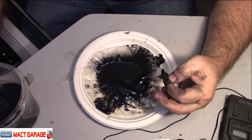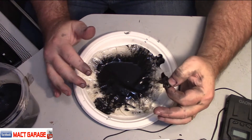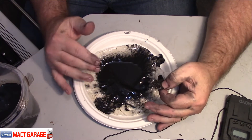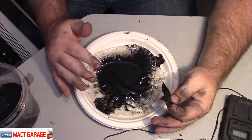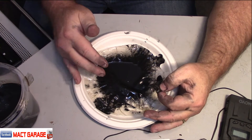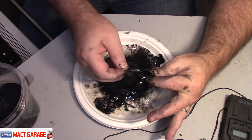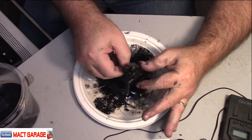So all this black that we're seeing is an oxidized — in other words, a burnt — additive. When we talk about oxidation: oxidation is rust, oxidation is a piece of wood burning, except at a faster rate, whereas rust is a slower rate. Well, the additives here are essentially burned because they've essentially changed to a carbon black. So we have all these things going on with this gear lube.